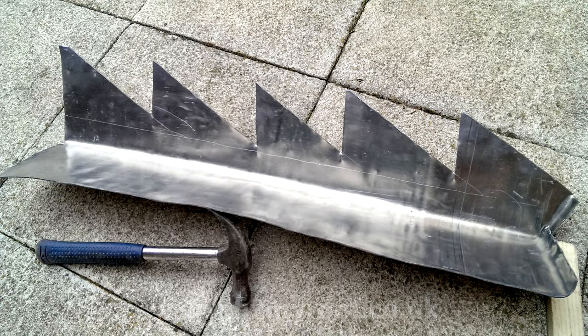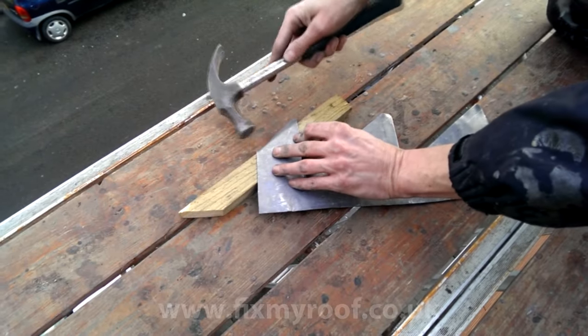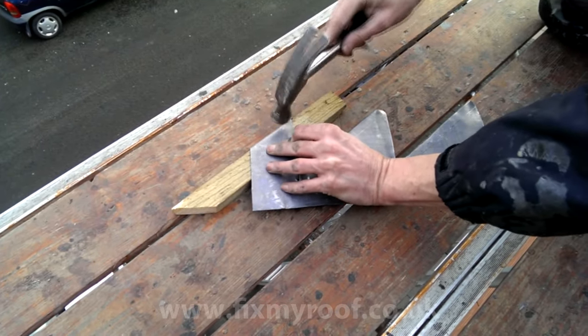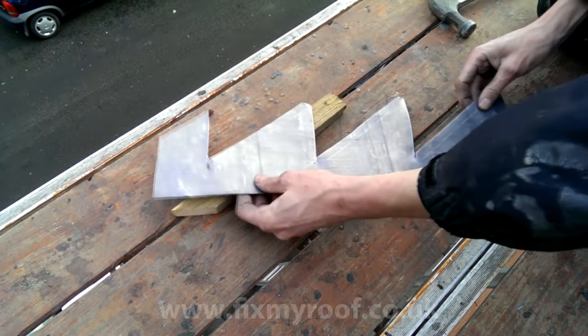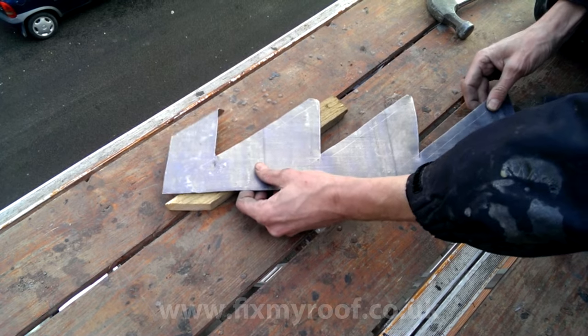And here is the step cover flashing cut into shape. Don't worry about any light scratches, after 2 or 3 weeks of weathering they will be completely invisible. All that's left to do is fold it on the chase depth lines we marked earlier, and that's done like this. This video is actually from my basic step flashing video, but it's exactly the same technique, just a matter of folding the lead over the edge of this timber like so.